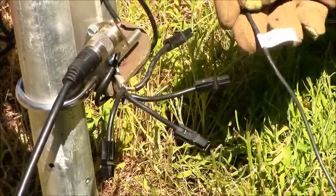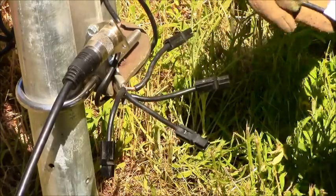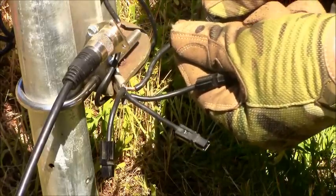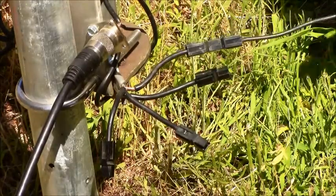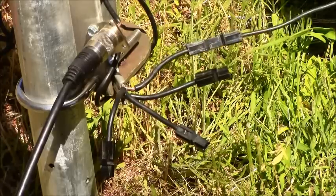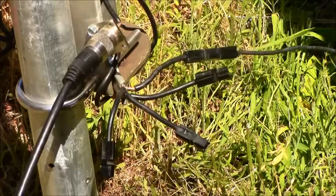The other thing I did was take my label maker and mark each radial — this is my 10-meter, eight feet four inches — and you just plug it in. My red 10-meter radial will go straight off the other side and just stake down at the end. You don't have to put pressure on these or pull them tight; they just have to be run out.